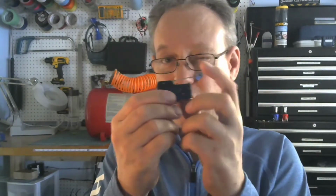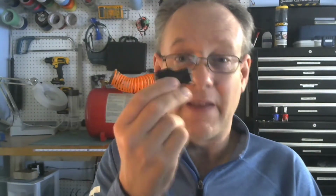However you look at it, I can get information from purely pneumatic systems with a limit valve, which gives me a burst of air, and I can do something with that. Or I can use a limit switch, and then I can do something with the electrical current or electrical potential that comes out of this.